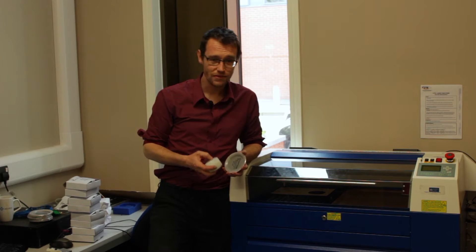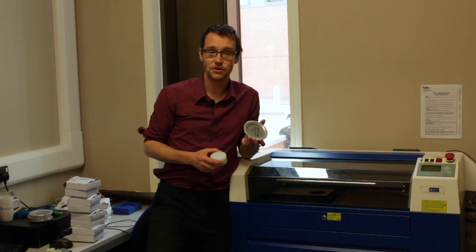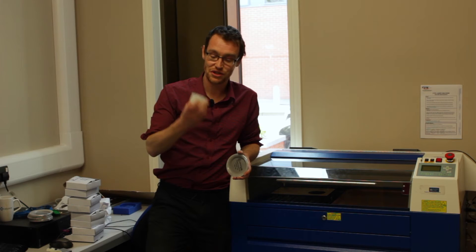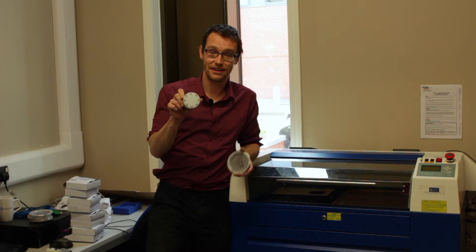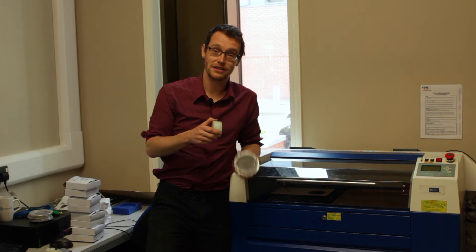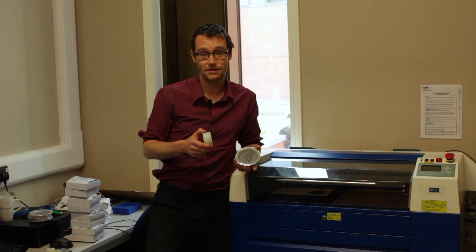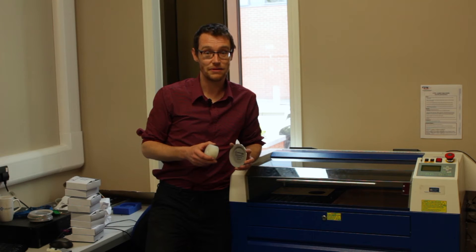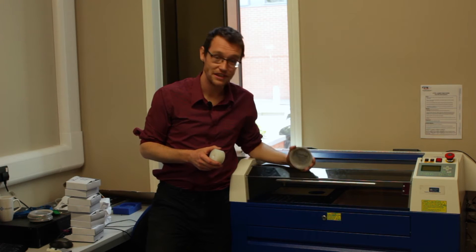After some research I found that these plates are usually held down by a vacuum bed, which we don't have. So in another 5 Minute Friday I'll probably show you the vacuum plate that I actually manufactured. After all that, we got the cycle time down to about 8 minutes, but with 200 plates that was just too long, so we've ended up settling for a laser engraving system.